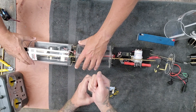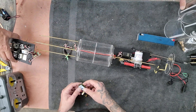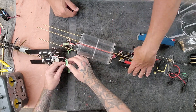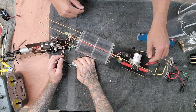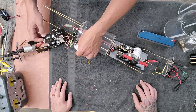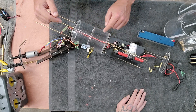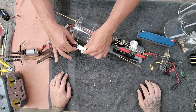That was a mystery that maybe will never be solved. Let me get Jason to start hooking up the receiver. This particular unit, which is interesting, is running an electronic speed controller for the pump, as opposed to the OTW dive controller. One thing to note with this: you've got two electronic speed controllers — one that controls the motor and one that controls the pump. Both have battery eliminator circuits in there, so they're both going to try to feed power to the receiver, which is not a good situation.